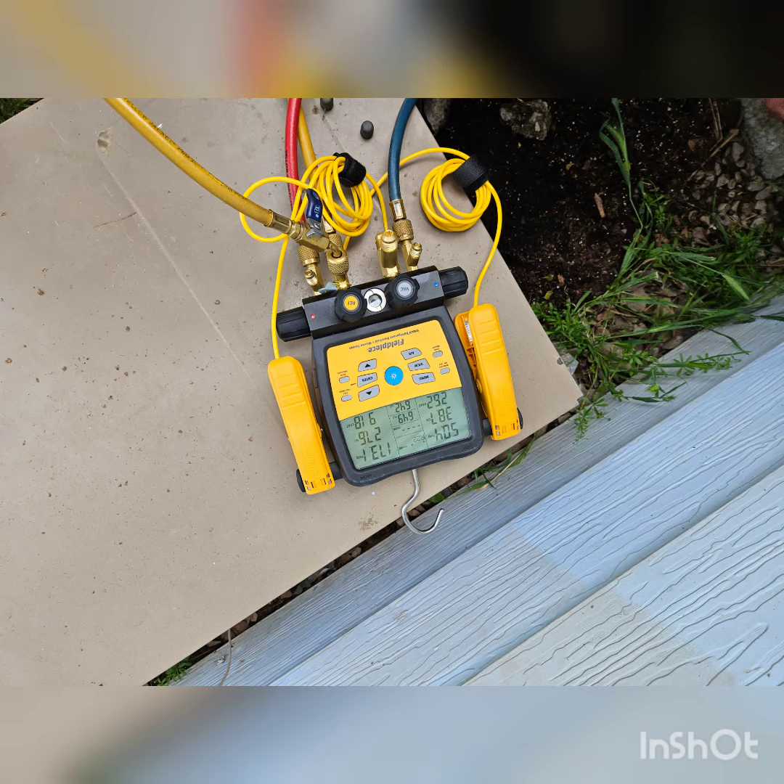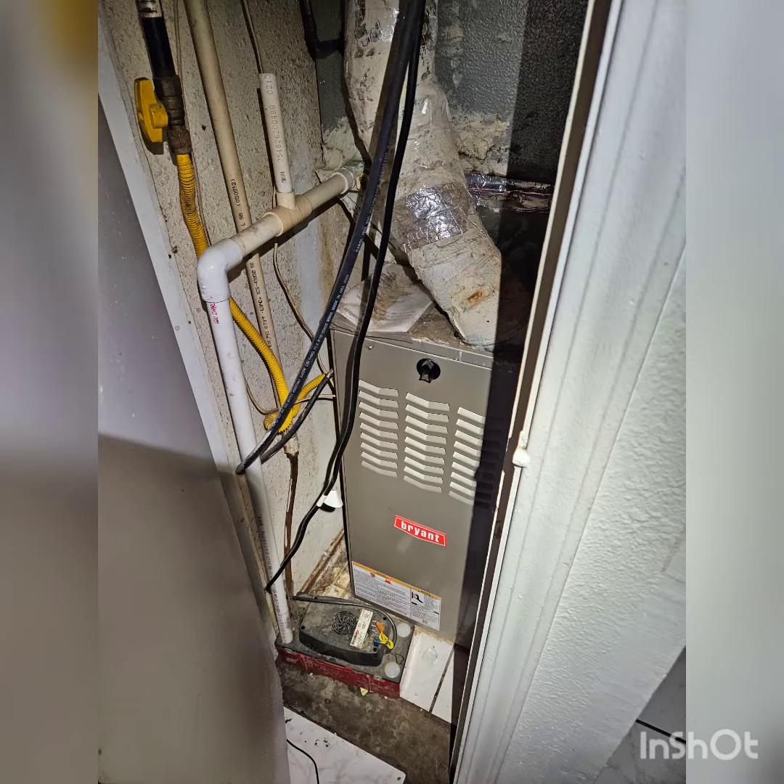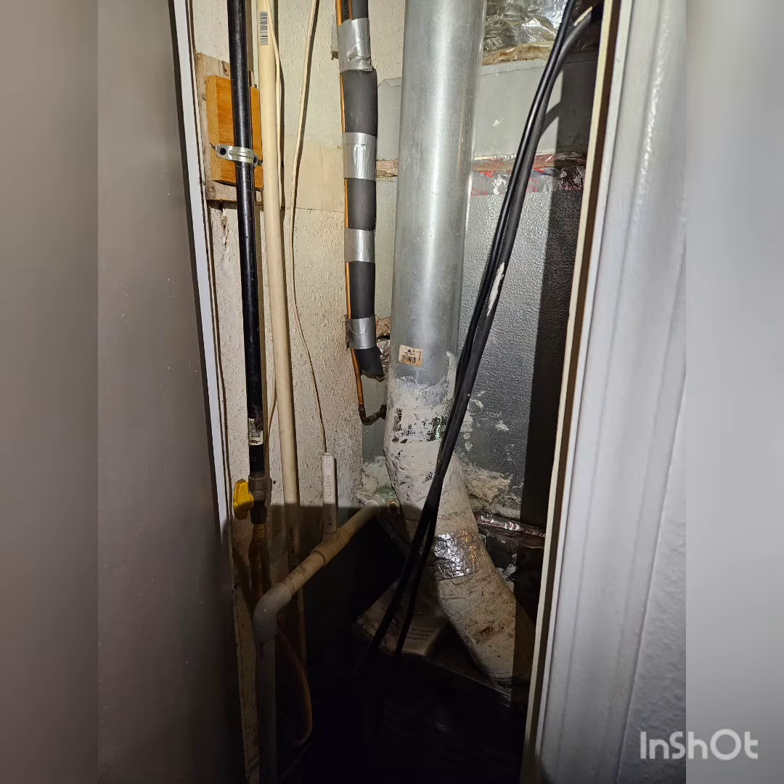I checked my pressures. This suction line right here — it was freezing, and that's another reason I'll explain later. The disconnect box is also incorrect — it's a three-phase disconnect but there are only single-phase wires there. And look at the suction line and liquid line, how they're routed going up to the ceiling — really bad.